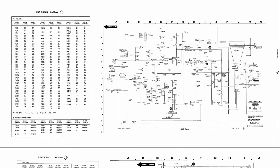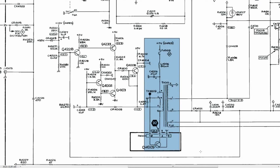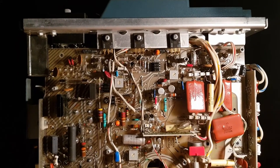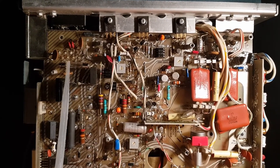This is the service manual for the Tektronix oscilloscope. Here we can find the schematic of the CRT power section, and the most interesting part for us is that section. As I said before, I have a problem with the fuse. After looking at the schematic we can find that the first element on the CRT power section is a fuse — and it's blown up.